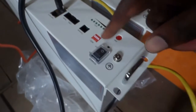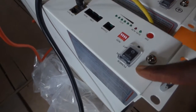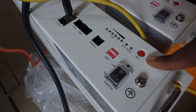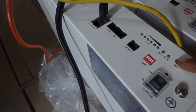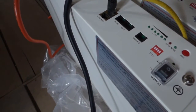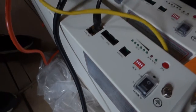You can see they have the standard dip switches, which we are not using right now. A power button — 0 and 1 — and your run button. So when you have them connected slave-master and they are on, in order for it to run you push the button on the master and it activates the slave. And then you have your CAN bus or serial bus connection that allows it to communicate with the inverter.